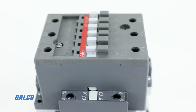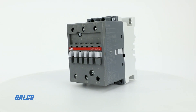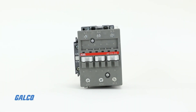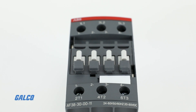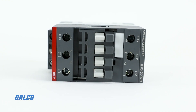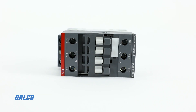Control motors as large as 1,000 horsepower with general purpose switching for up to 2,650 amps. The AF-series contactor has built-in surge suppression and can overbridge voltage drops to maintain uptime. AF-contactors also have a dedicated 24 volt DC coil for direct control by PLC output.